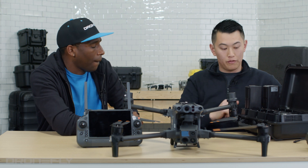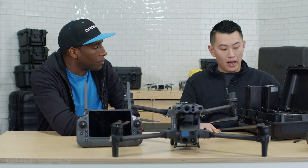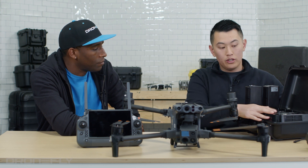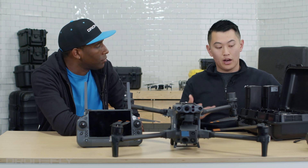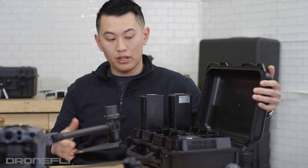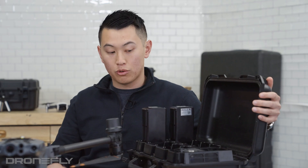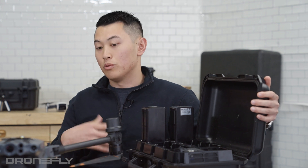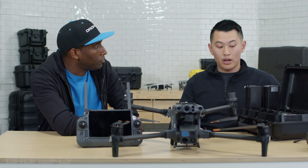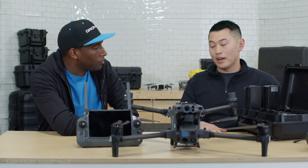They're going to charge one set at a time to be more efficient. So let's say you had four sets in — it would charge this set and then the second, third, and fourth. We have two new modes on the charging station: fast charging and storage charging, plus your normal charge. In a real life situation, you don't want to be charging your batteries to 100% — it takes the longest. Between 10% to 90%, you're able to charge quicker. The storage charge mode basically keeps the batteries at 50%, which is healthy — if they're going to be sitting somewhere long-term, you want them at 50%, not empty or full.